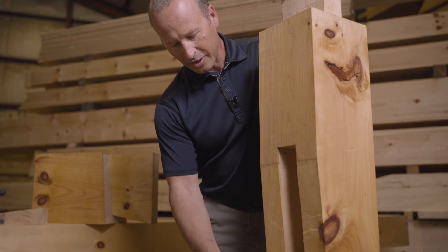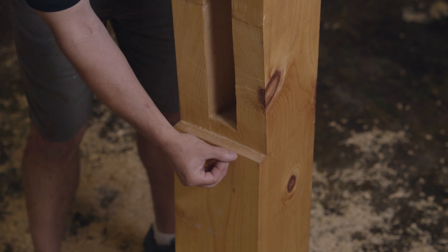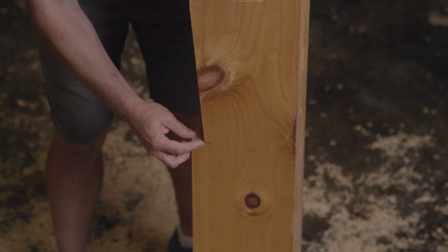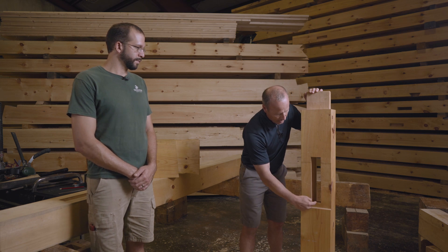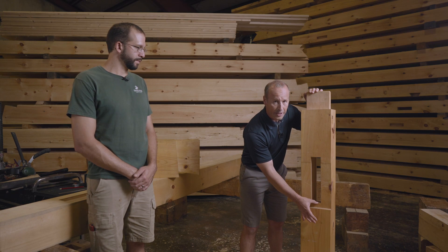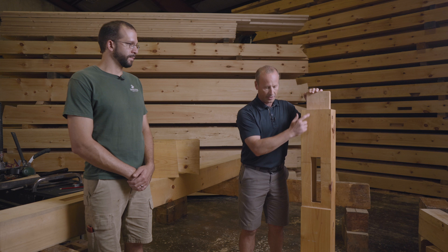When we were doing the layout for post one, we measured up to 110 inches — this is described as the shelf cut line. It's one inch deep, so if you look at the north or south elevation of post one you can see that cut. If you look at the east face of post one you can see the mortise indicated. The bottom of the mortise is at 111 and a half inches, the top of the mortise is 121 and a half inches, and the tenon is at 136 inches.